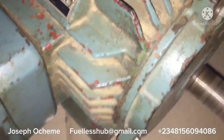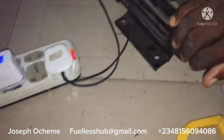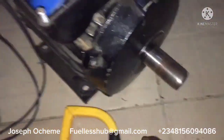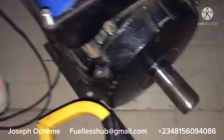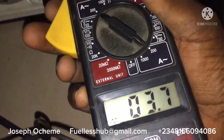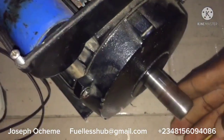Here is a 2-horsepower motor that is spinning. I'm going to show you the normal way — what a normal 2-horsepower electric motor consumes on idle. I'm running it from an inverter right now. So it's consuming 3.9 to 4 amps on one phase and 2.9 to 3 amps on another.